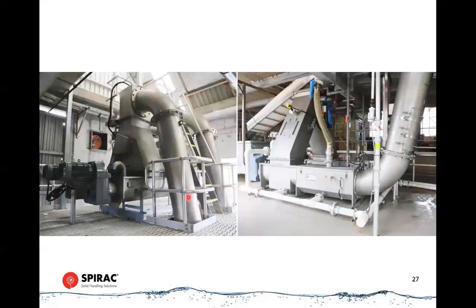You can see in here the tapering of the discharge pipe. We're expanding it from front to bottom to accommodate the expansion of the screenings as they travel up the discharge pipe. We have a bifurcated chute here, so we're dropping screenings either into conveyor A or conveyor B, sending them on their way probably to a spirotainer.